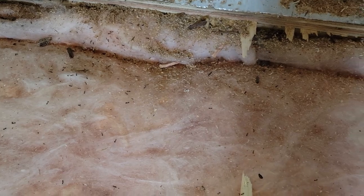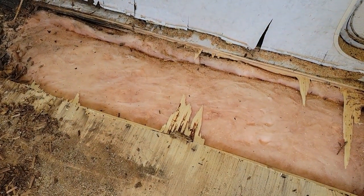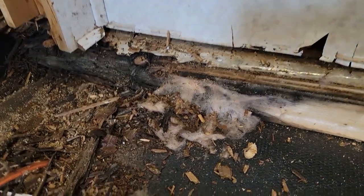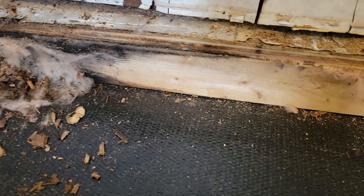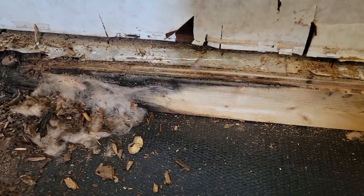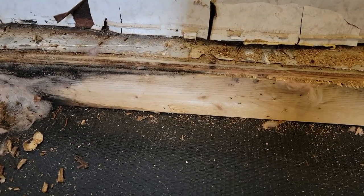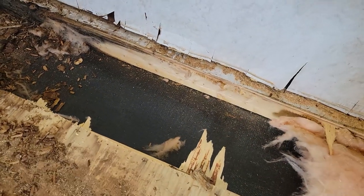There's a lot of ants in here, so as I have this off I'm going to have to spray for them because we don't want those in here — they'll just keep eating the rest of the stuff up. I pulled the insulation back and it looks like we have good wood all the way up to just about that corner. I'm going to be able to stub in another piece. Not exactly sure what kind of joint I'm going to put in there, but I'll put a joint in there to be nice and solid. Let me get some ant spray.